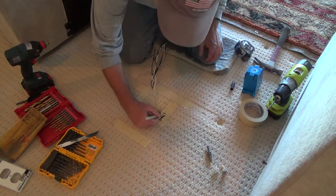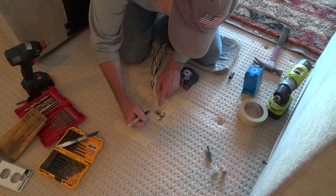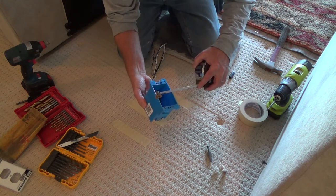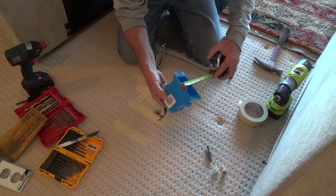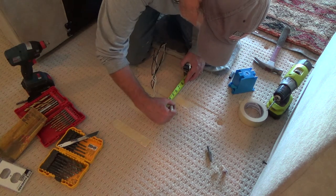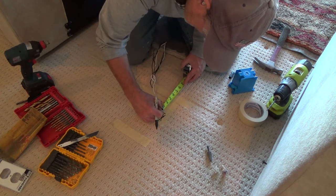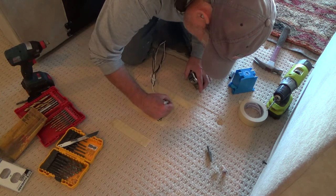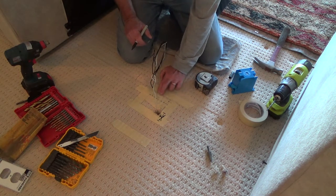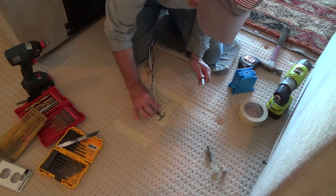I'm right on the edge, so I went over to the center of that five-eighths, and that's going to be where the edge of my box is. My box is about two and three-eighths, about two and five-sixteenths. I'm holding on one inch and then going over three and five-sixteenths — that's where the edge of the box is. I cheated it that way just a hair to get it away from that wire next to the plywood.